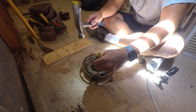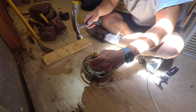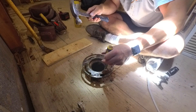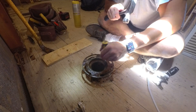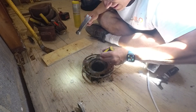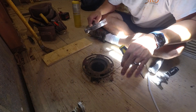Ever so slightly ease it over - you can see it's loosening up a little bit. I'm bending this back because I'm going to cut about half inch of this off anyway, because I have to bring the flange down a little bit. The rest looks pretty good. Now that the heat has set in a little bit, I'm going to hit it with the torch again.